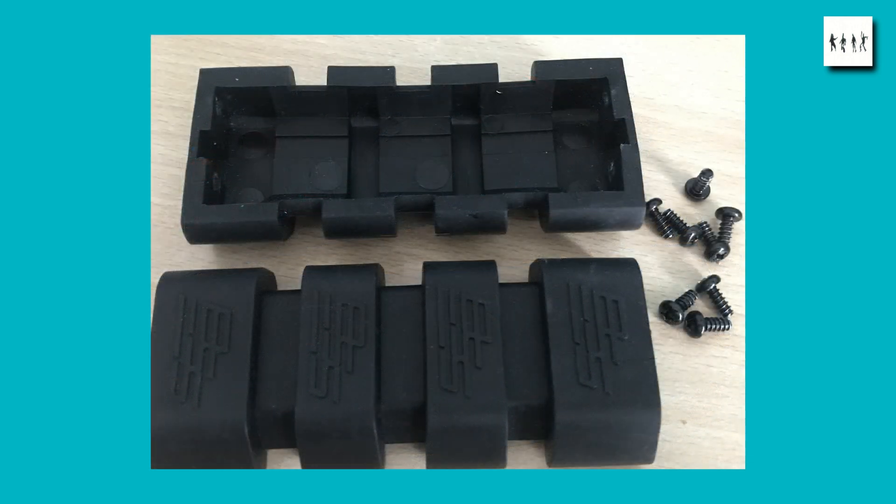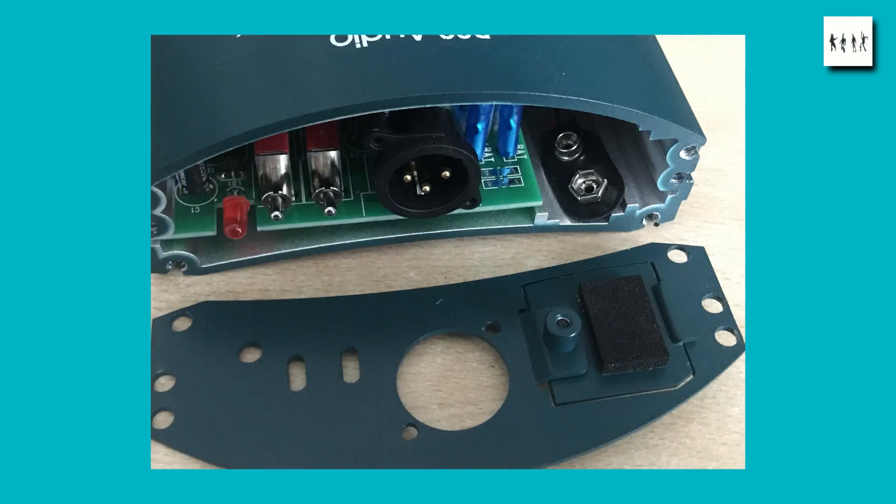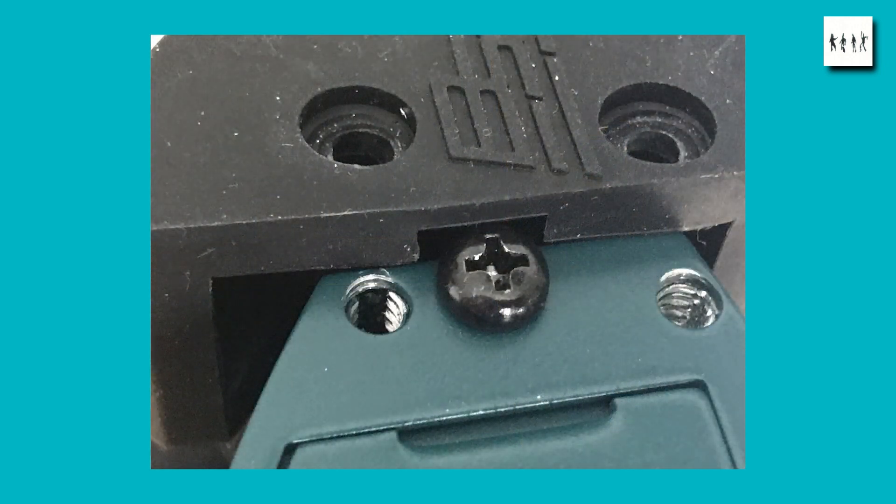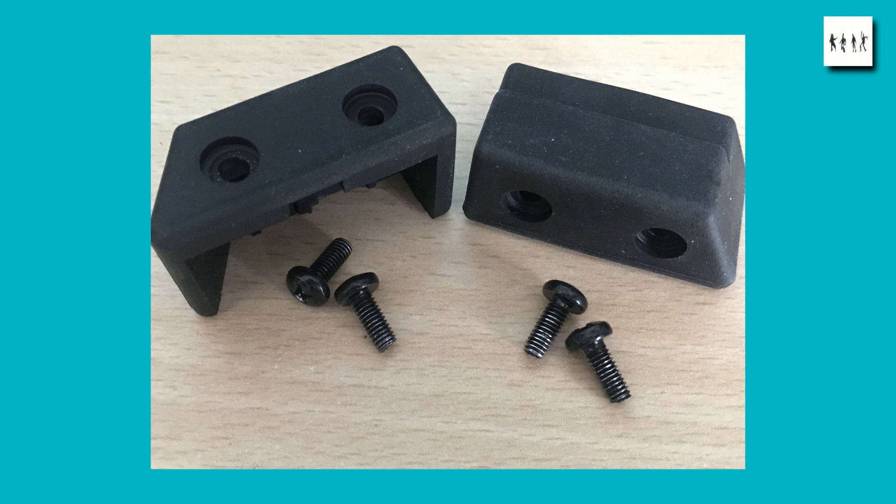The AR133's approach is slightly different. It has again two screws at each end of the rubber feet, but when you take those off you find that there is a separate screw either side of the front panel and the back panel to hold that panel on, and all these screws are self-tappers going into a non-threaded hole. Interestingly, the cutout in the BSS rubber feet, which is provided so that it will slip over that additional securing screw, also appears in the Millennium design, although of course there are no additional securing screws for it to clear. Very odd.